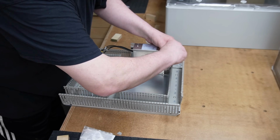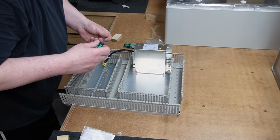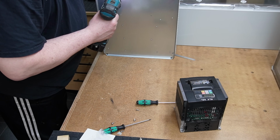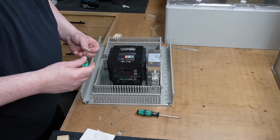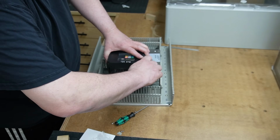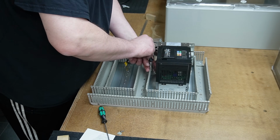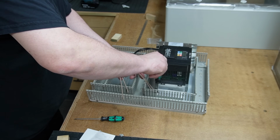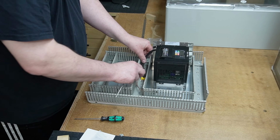The main part of this cabinet is of course the VFD. I use a 400 volt 3-phase Omron MX2 with 4 kW and 1000 Hz. It comes with a Schaffner EMI filter and an external brake resistor, which all go side by side on top of the board. In case the cabinet is deep enough, the EMI filter could be oriented horizontally and the VFD could be bolted on top, because it has a dedicated thread pattern for it.